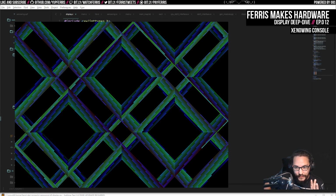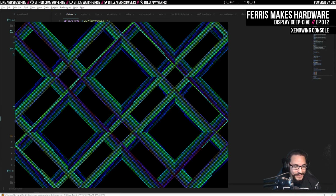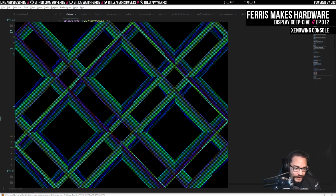And when I did the math for that, I think I assumed that instead of getting 24 cycle latency, you'd get 20 cycle latency. And with that, we still end up spending like 60% of the frame. Just assuming everything would work, I just did the math for it. We'd spend about 60% of the frame reading data out for the video. So I thought that wouldn't work.